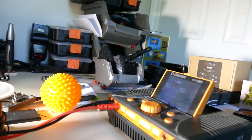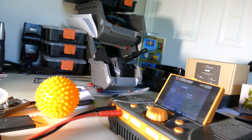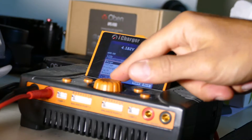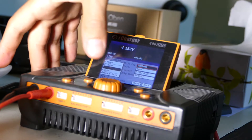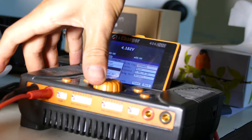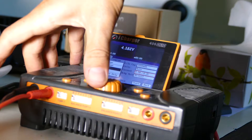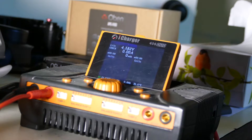I had a total loss of audio recording on the camera, so I'm doing a voiceover to show you what I'm doing. We've got the battery connected up to the iCharger, and I'm going to select discharge — discharge it at about half an amp. Setting lithium ion capacity to 1800 milliamp hours, auto detect the cell as one, discharge at half an amp current, and our stop voltage is three volts. As soon as the battery hits three volts, we stop the process and look at how much capacity we have. The milliamp hours will be counting as we go, so we'll come back and take a look.